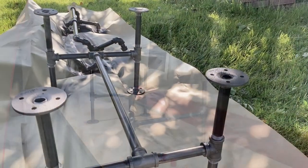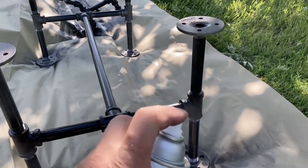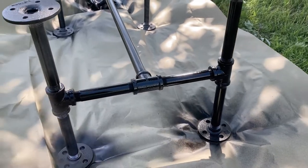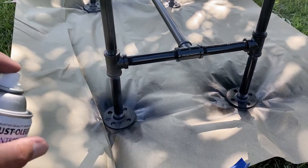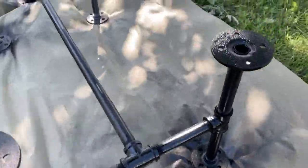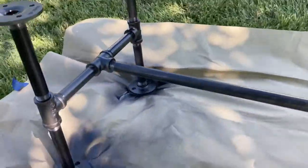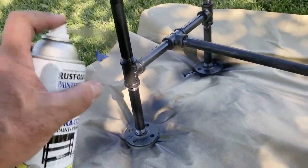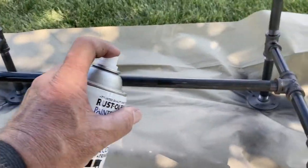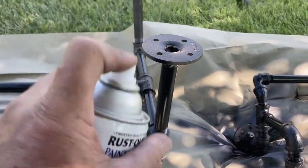Get a square and a level and you're good to go. Make sure you've got all the oil wiped off, then I just moved mine outside on a piece of paper and spray painted it with a rattle can — easy as pie. I put Rust-Oleum on it; mine's a semi-gloss, cheap stuff, four or five bucks a can. You can get quite a bit of black pipe sprayed with just one can. Go ahead and finish coat the pipe, and when that dries we'll go to the next step.